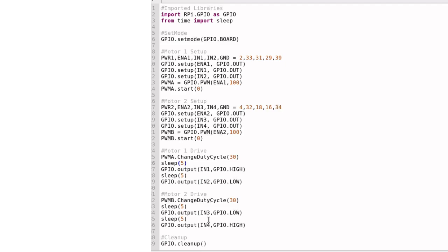That's pretty much it. I'm going to be finishing up and debugging this code soon and will hopefully have it in the description. At the bottom, as always, we want to have GPIO.cleanup. All this does is set back all of our GPIO outputs back to inputs, so you don't accidentally short-circuit something. Since we're dealing with electricity, we don't want to short anything, and this just brings everything back to the way it was before the code started.